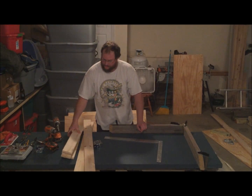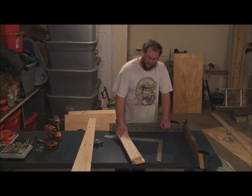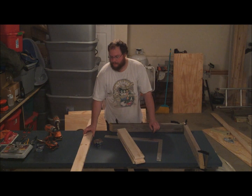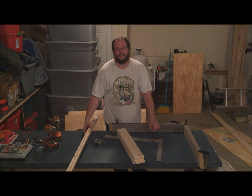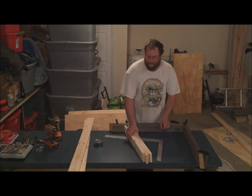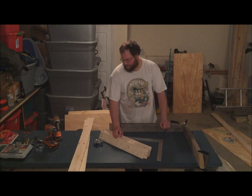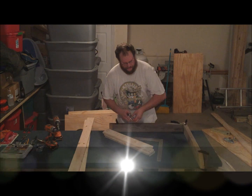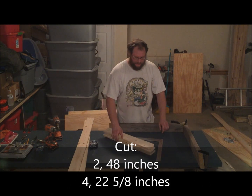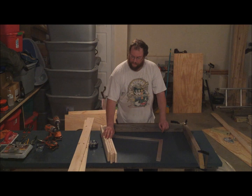When you make your cuts, take your four 1x4x8s and cut two of them to 48 inches — we're going to do four total for both boards, but worry about one side right now. Then cut four pieces at 22 and 5/8 inches. That'll make up the thickness for a full 24 inches because these will be on the inside.